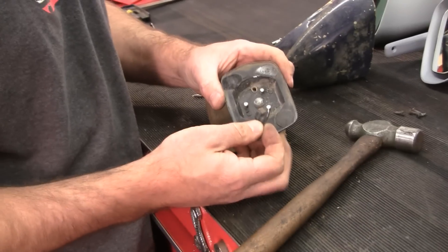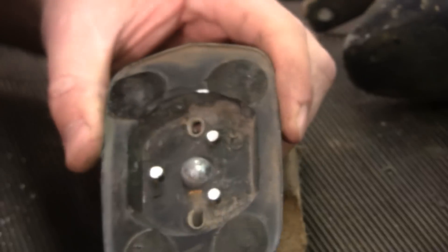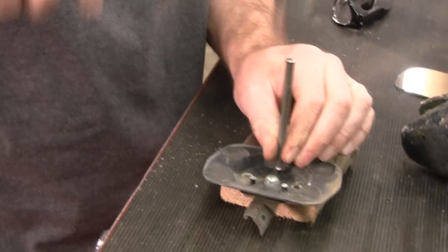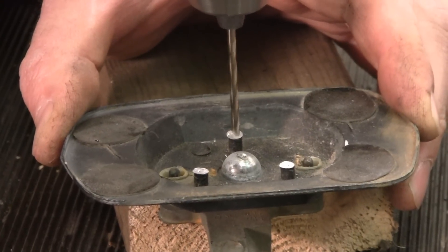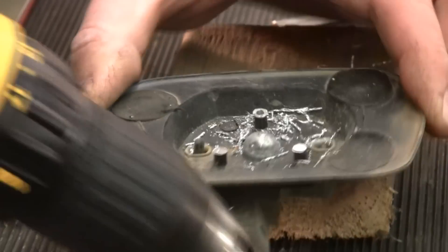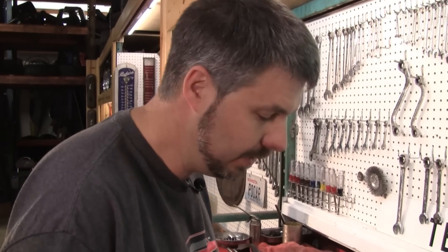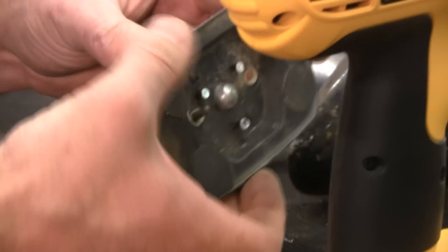Here's part two. To reattach this, I need to drill holes and then get some self-tapping screws. It seems like every time I do this I grab a different bunch of junk screws out of my drawer and a different drill bit — I'm sure you'll figure out what size to use. I go ahead and go all the way through. Somebody that was very meticulous would only go the depth they needed and then tap this and get machine screws, but I found this holds fine.